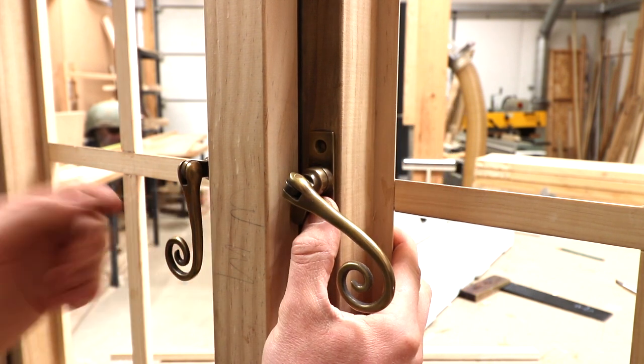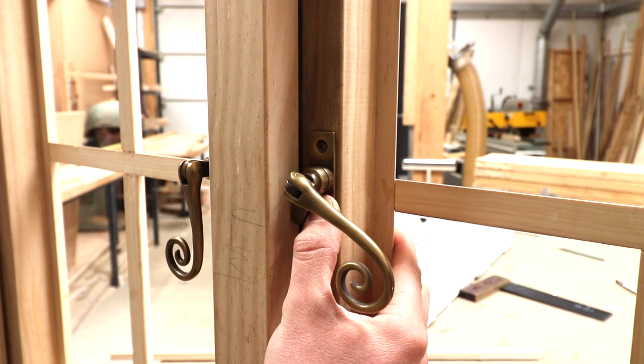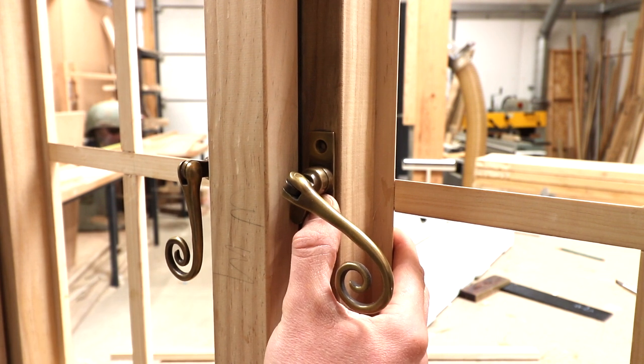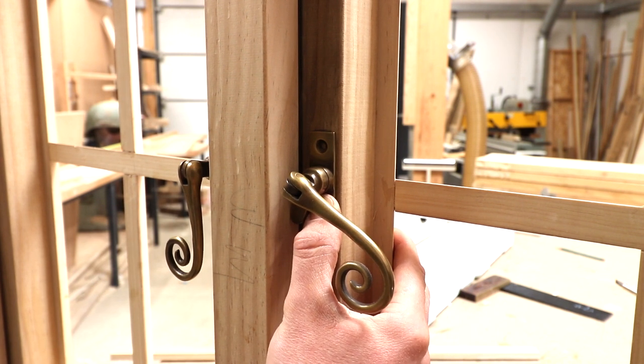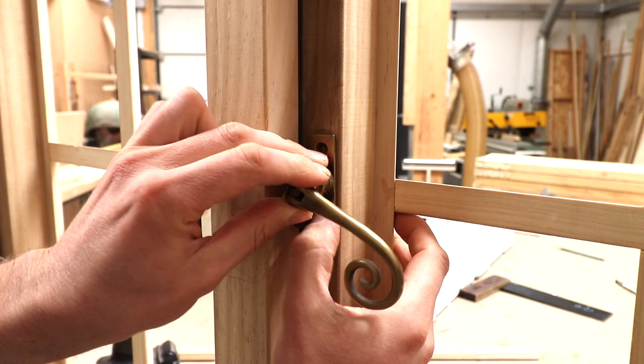I chose this spot here so you've got about two to three mm of clearance and it's perfectly in the range of the fastener working properly. This is the trickiest bit — you've got to hold that casement with one hand and then drill the pilot hole with the other, made even more awkward by the fact there's a camera in the way.